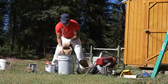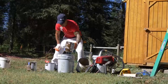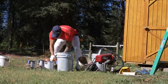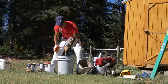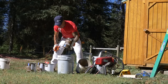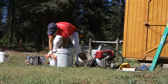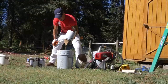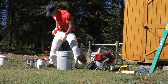I want to verify — cabin brown is what I'm staining the color with. This is our Woodscapes solid color stain. Stains are different than paints because stains actually absorb into the wood. It's more natural. If you want it to look natural and not painted, a solid color stain is going to give you that look. It's still going to give you the wood grain and texture — it's not going to create a thick coating over the top, eliminating some of that.